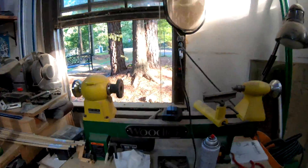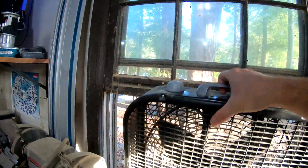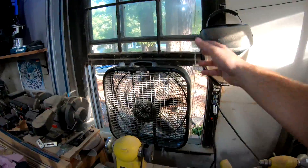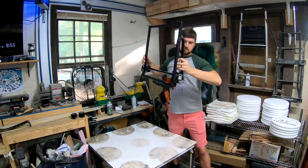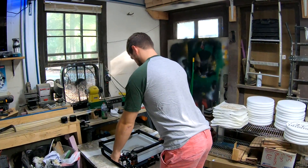If you were to set up your laser inside, I would recommend just getting some type of box fan — put that fan there, turn it on, and that will extract the fumes and smoke. One of the major upsides to the diode laser is it's so lightweight you can even hang it up on the wall to keep it out of the way when it's not in use.